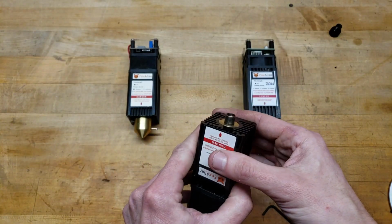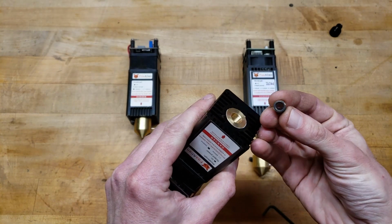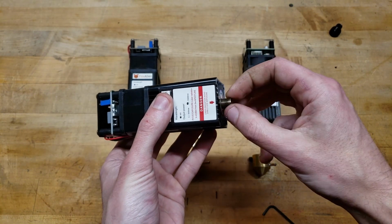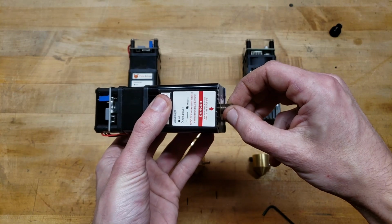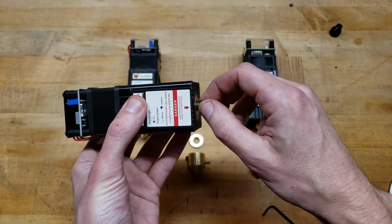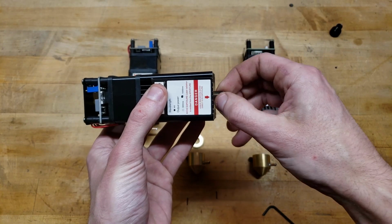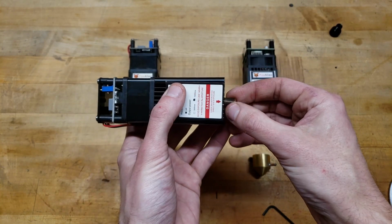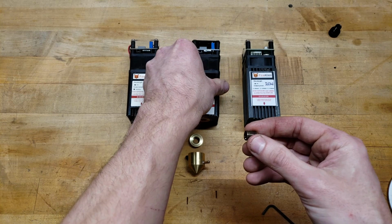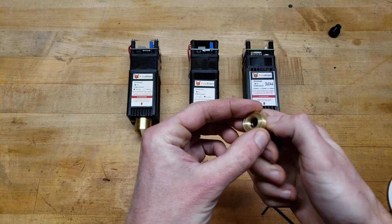So if you've got a G8 lens, which I highly recommend, this lens is amazing, and if you have one, then you know the one issue with it, and that is that you only got to screw it in about like a turn or a turn and a half, maybe 2 turns most, and that's to get it at its sweet spot, 30 millimeters. Any more in, and that brings that focal length further away, but you want it to be right at 30 millimeters. So the solution for me and for most people is usually to put a huge amount of Teflon tape onto the lens, but with my lock ring you can screw it right in